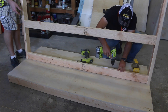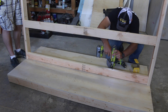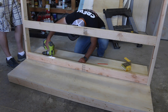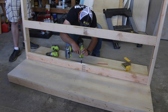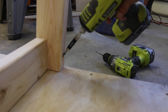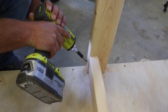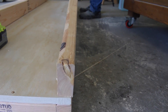Place the separator on the platform and connect it. Pre-drill and then attach to the platform at each joist location — about four-inch long screws work well, but shorter screws can work if you countersink them enough. Attach the vertical boards by pre-drilling and then putting the screws in at an angle, or toenailing them in place. Using pocket holes would also be a good way to do this.